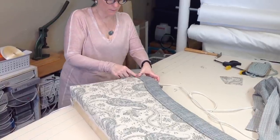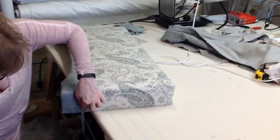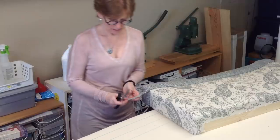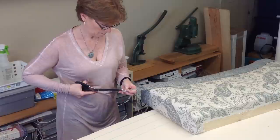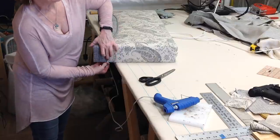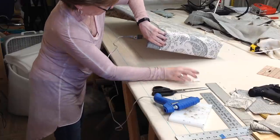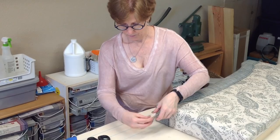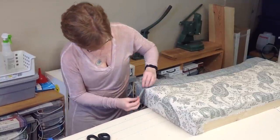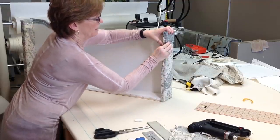When I get down to the end edge, I stop gluing for a minute. I measure where this would go, cut a little ways past the back of my leg, then peel open the stitching that Zona put in. I peel this back, trim my welt cord at the back of the leg, and shoot a couple of staples to finish it off.